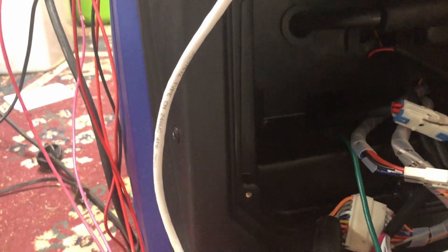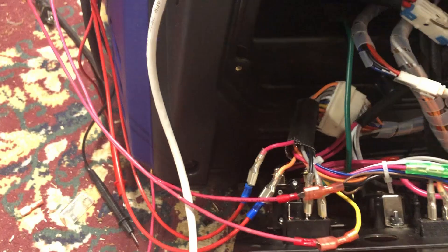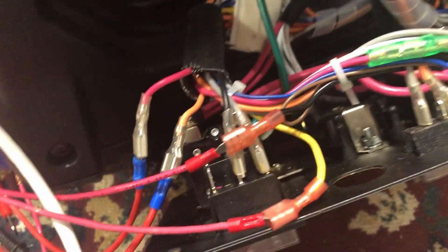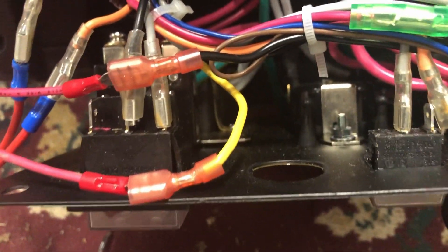So what I'm going to do is parallel some relays in with these switches. Right now I've just disconnected the switches temporarily to allow testing. The red and orange wires over here are the two wires from this switch right here — that relay enables turning on the electrics on the generator. And the yellow and black wires are the wires that were in that little hole right there for the start button.